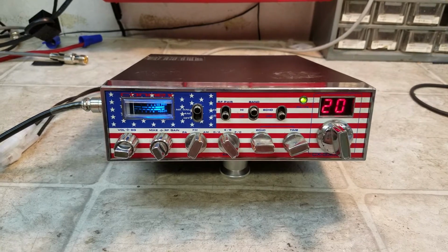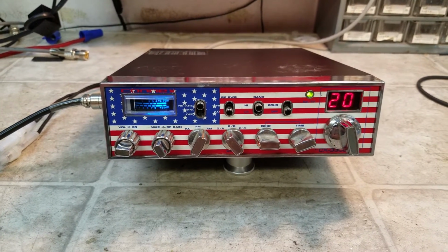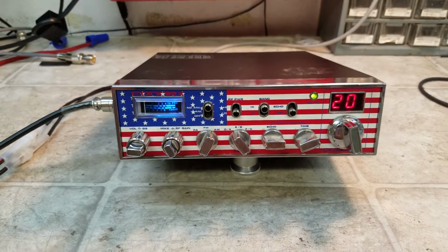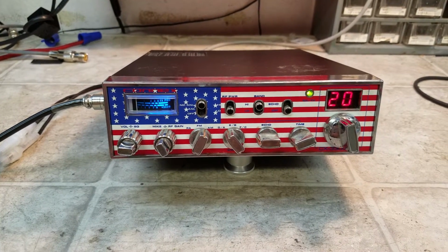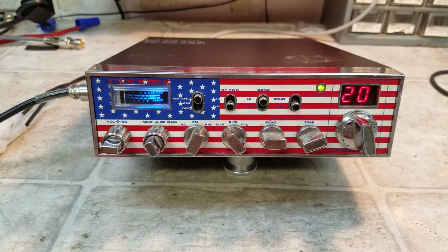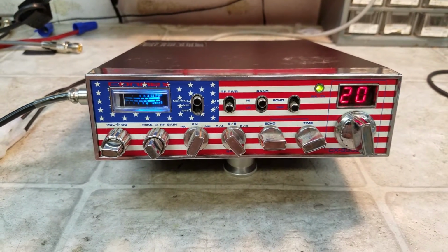Looks like maybe it had a little bit of a bumpy life, maybe in a big truck. Had a lot of cold solder joints. Took care of that. Got your speaker working as well. Got your meter working as well. Somebody else had done a couple receive mods in here on it. I deemed them were A-OK, so we left them alone. And we went through and did our peak tuning alignment, which you're going to see an incredible difference in performance.